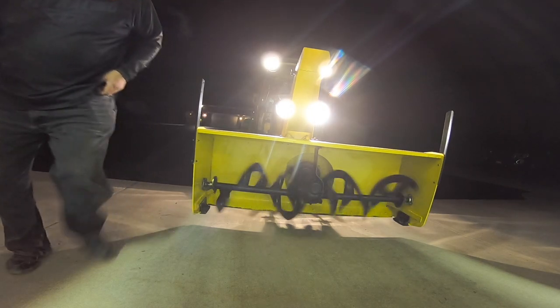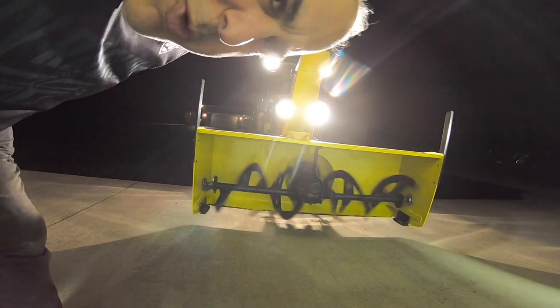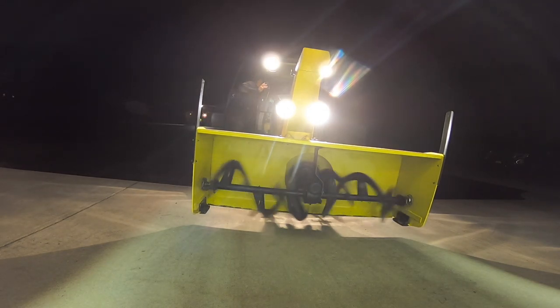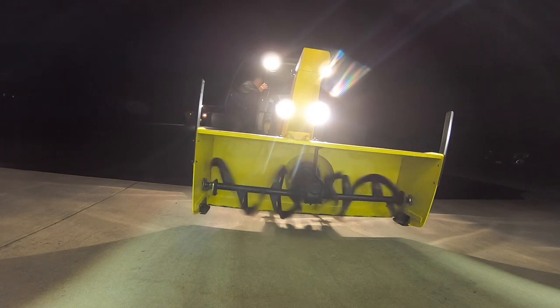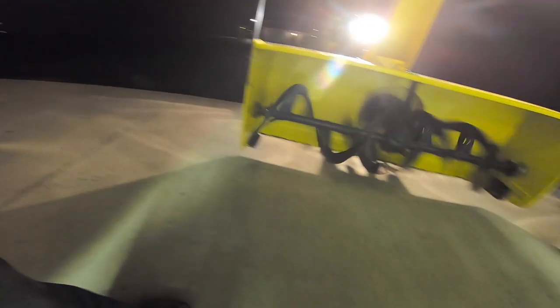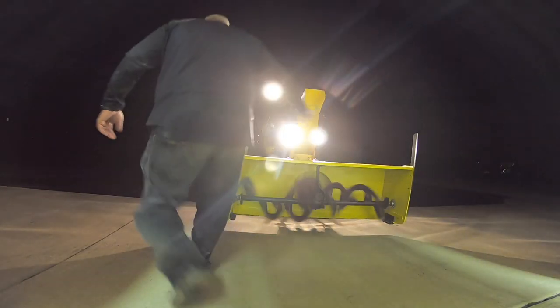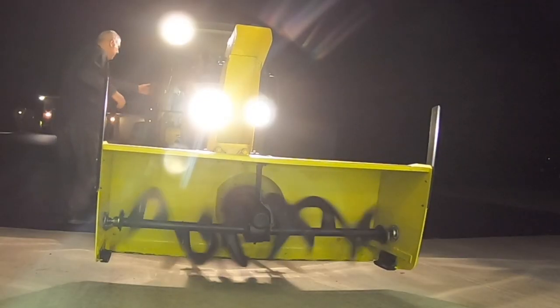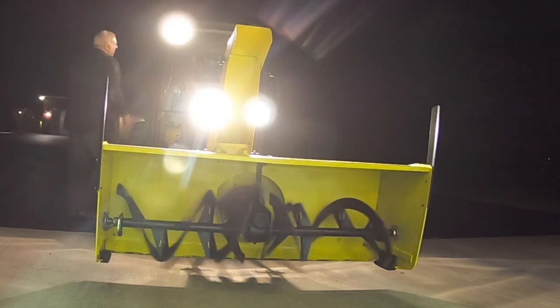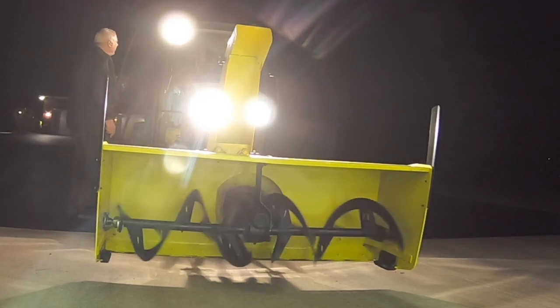I want to keep this channel real, and I hope you learn from my mistakes. I put this off too long. Knowing what I know now, if I bought the snowblower new, I would check the auger bearings every four to five years and probably replace them on the fifth year depending on how much you use it. My five-inch grinder with a cut-off disc was essential in removing the bearings — I wouldn't waste time with a puller. Super gluing the bearing race and spacer on reassembly was a huge help, as were the wood shims under the auger to align it with the holes in the snowblower shell.